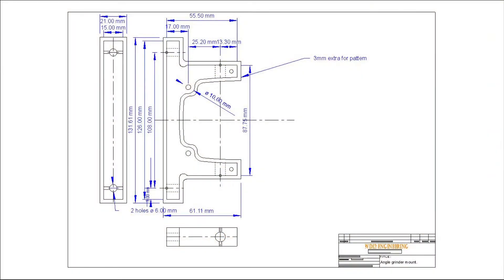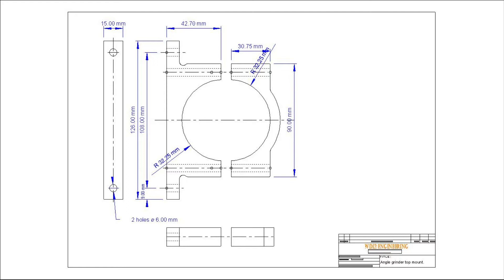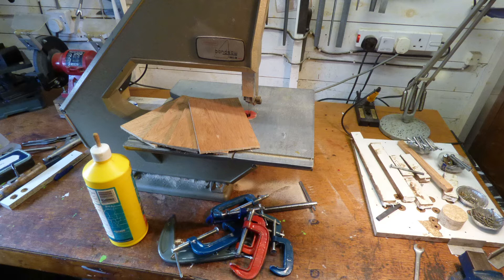This is the design for the bottom mount. The outer profile is the size of the actual casting, and the inner profile is the finished size — this is a 3D model of it, generated by Vectric VCarve Pro. This is the top mount, which will be made in plywood, and the two parts here will be milled at one time. To get the required thickness I simply glue together several sheets of 5mm plywood.